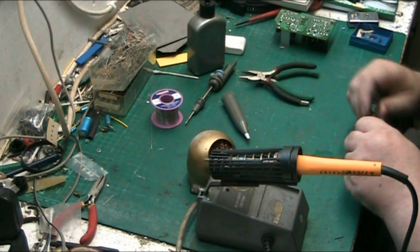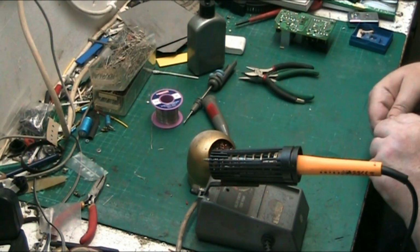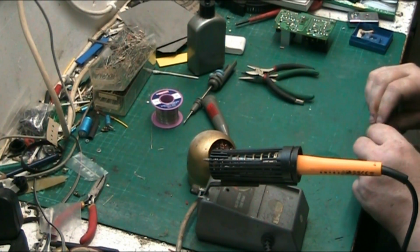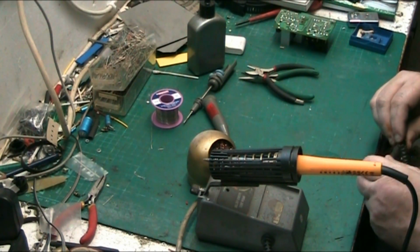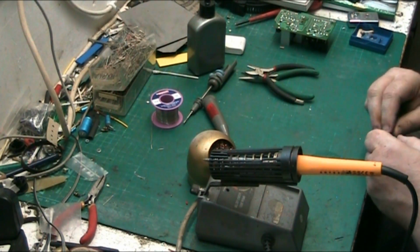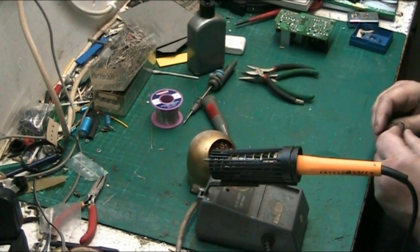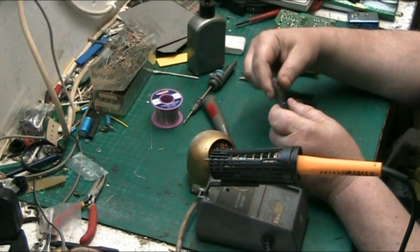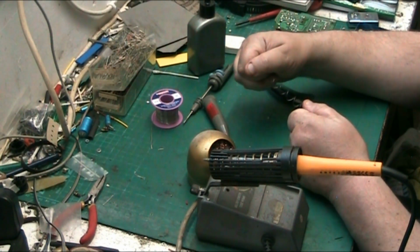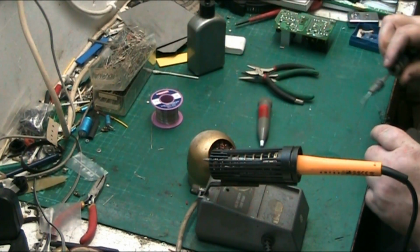And it'll stop contaminants sticking to your spring. And also, if your spring is not quite strong enough, if it loses its tension, if it loses its springiness, then all you do really, there's a piece of solder on there and it's going to do my head in because it's moving around and I can't pick it off. There we go. Basically, you can actually stretch your spring a little bit. Just give it that. That's all you need. Stretch it a little bit and it increases the power of your sucker a little bit.